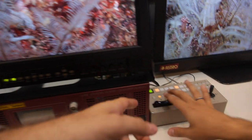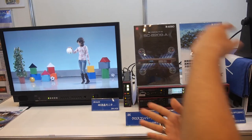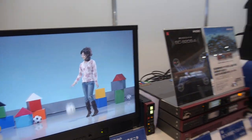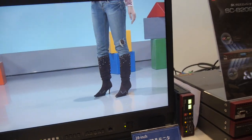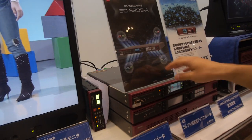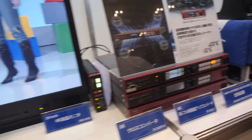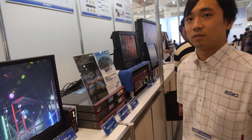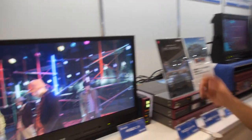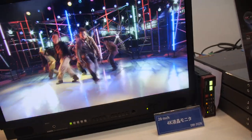It's very interesting. So you have the solution there. Can I look in there? Is this secret? It is secret, okay. And what is this? This system is comparing HD to 4K — upscaling to 4K. This machine does that upconverting. It needs a lot of FPGA power to do it right. The best upconverting requires psycho-visual analysis of the picture to find out how to fill in the blanks. It's magic a little bit, but it's fake — it's not real 4K.